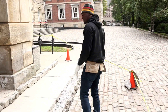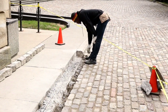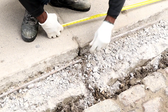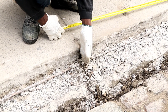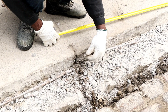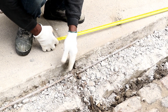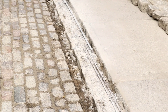Usually wherever you have a joint, you break it right here. Now we're going to make our cut — for our rebar we want to start the joint right here. Put one here and another one right here, so after we pour the curb we can come back and cut our control joint here. We're going to tie it just like that. This one I'm not going to use but I'm showing it for demonstration because it has cracking and it's corroded. From here we're going to measure another 20 feet and break it just like this again, continuing all the way up.